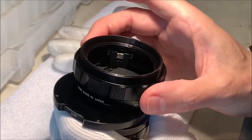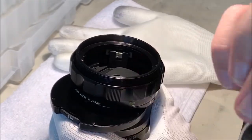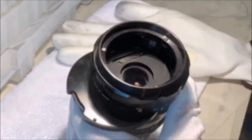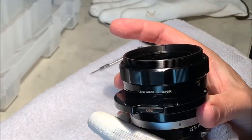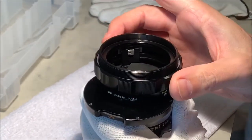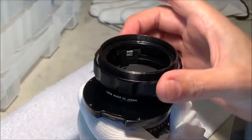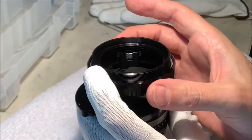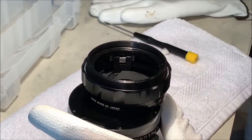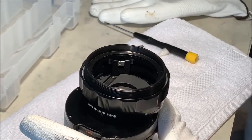Before, the focusing ring was moving up and down slightly as it turned and it seemed all smooth. Then when I put the shim and the objective locked on, the ring starts bearing against this and forcing that wedged-in key to slide, which it doesn't slide very happily. So I need to loosen up that key so it's not in a wedging condition. Maybe I'll put just a little touch of grease on it so it slides smoothly. I put a little bit of grease on the face of that shim so it can move smoothly on the shoulder in the focusing ring. I went back in, loosened up the key, and now it's smooth totally.